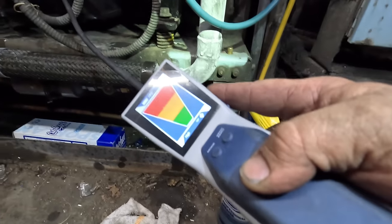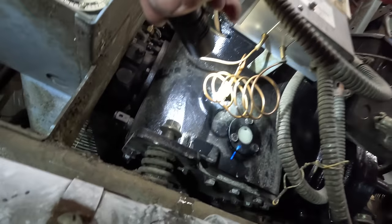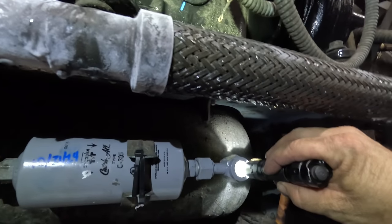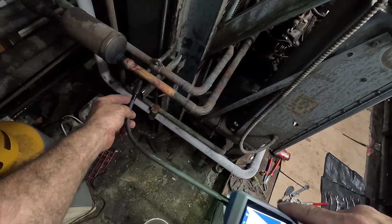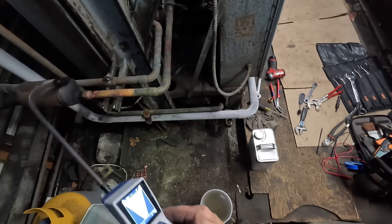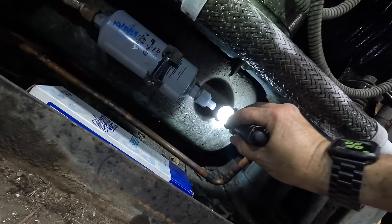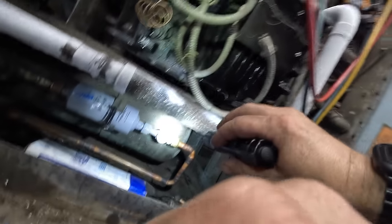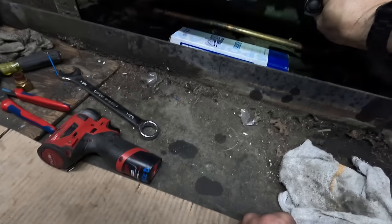We do have one little leak up here though. He's got the new seal in it. Still adding — 70-some pounds already in it. It's a hungry little hippo. We're adding — if you're watching, just see that foam in the coil there. We're getting really, really close. We have a little bit of a leak there on that. When I come back I'm going to cut this muffler out — you can see where it has some oil. I've got a little bitty leak there. It's warm. Yeah, there's bubbles again. They'll do that for a while — just sit there, go solid, and it comes back. You can't just fill it up and stop.